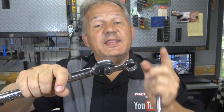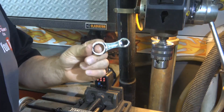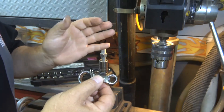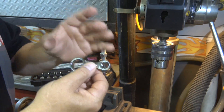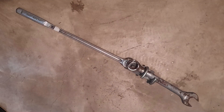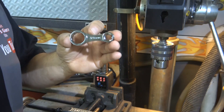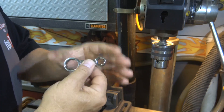You know me, I love to do tests. First I'm going to apply torque straight, then I'm going to put this extension on, measure the torque, and then see what happens if I take this extension and rotate it 90 degrees. It's really important to have a tool like this with a known distance, because over the 30 years I've been in industry I have seen people make homemade extensions that are completely ineffective. They think they're applying torque but they absolutely are not. So making your own tool is not as good as buying something like this — they're not that expensive. Get yourself a tool like this so that you know the length and you're applying the correct torque.